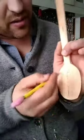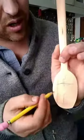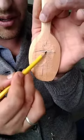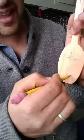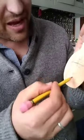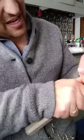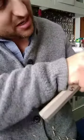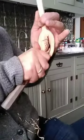So remember, this is the deepest part of the crank right here. This is where the grain change is. And so all of the cuts essentially need to be made in this direction from here up and from here down. So the reason I'm going at an angle is that it allows me to make these cuts that are coming in here like this, even though I'm essentially going uphill a little bit. You can see I'm coming in from the side, and I'll leave them attached just so you can really see them. Sorry, now this drives people crazy. Okay, so in from the side here. Good.